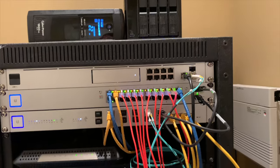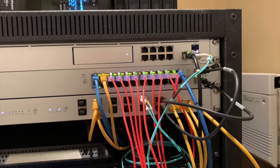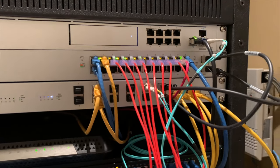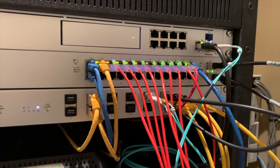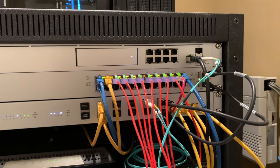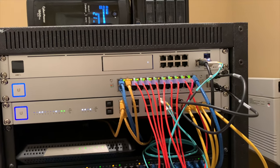Let's take a quick look at my own server closet, where we can see the three connection types actively being used. RJ45 twisted pair cables form the bulk of the wiring. My general color coding is that blue is regular old gigabit, red carries power over ethernet to the switches and access points that need it, and yellow is 10 gigabit.